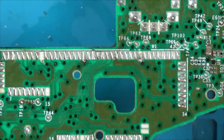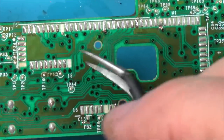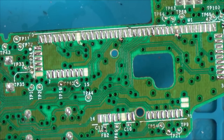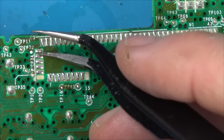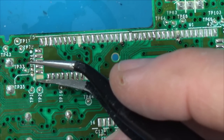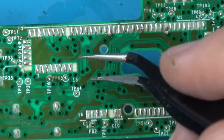Okay, that was incredibly hard, even with all that low melt solder on it. Because the thing is, there's no real way to grip the board to take it off. I'm unsure whether I'm going to go through with this now because I've got so much repair to do. So you can see all these pads are okay. This is not, this is gone. That goes down to that little via there. That is fixable though. This one's missing, that goes to that via.